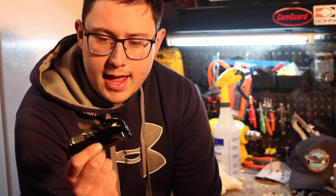So when I was doing my research before doing this little restoration, I found there's a lot of hate out there for this little 75 Rabbet plane, and I think one of the main reasons that people mentioned was the discomfort in using it. The natural way to hold it puts the web of your hand right against the iron, and there's just not a good way to grab it that feels natural. But this little guy is meant for the awkward corners that some of the bigger Rabbet planes can't get into, so hopefully we'll be able to put it to use.